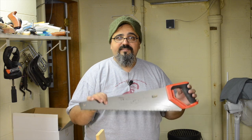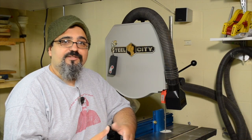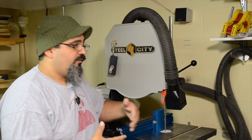With that said, let's head over to the bandsaw. The bandsaw is my preferred tool when it comes to re-sawing, and I think for the vast majority of the industry this is the go-to tool for any type of re-sawing. Number one, that blade is so much thinner than the table saw blade, so you're going to get a higher yield of material from your thicker board — especially if you're making veneer from a particularly beautiful board.